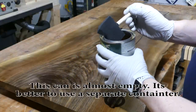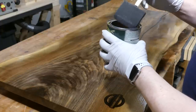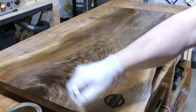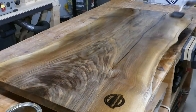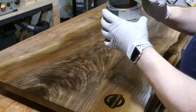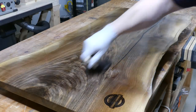I want to get as much finish off my brush as I can — you can see it dripping. I still have to do the other side, but I'm going to cut back this finish and try to soak up any pools on the surface. I'm not tipping like this to soak it up — I want to get it flat. Long strokes are best, just covering the surface. If you have to, stop and get some of that finish out of your brush. Some people will take paper towels or disposable rags and just soak up the surface. I'm going to get right down on the surface and look for any pools in the light.